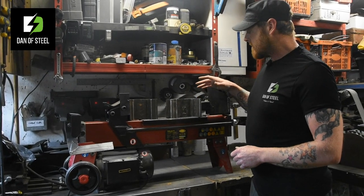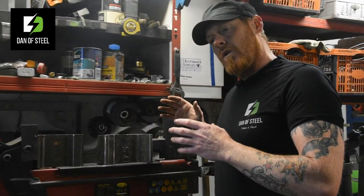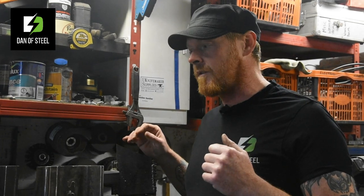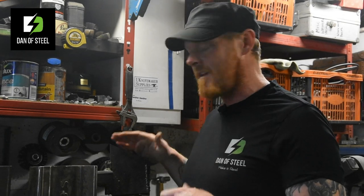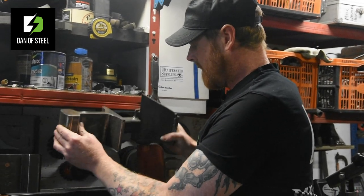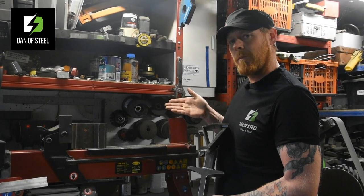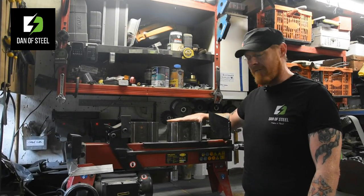Then the die themselves, the key to these is very much the fact that you want to be able to change them quite quickly. So just taking a load of scrap steel that I had from the Vandersander build and also the Revolution 2x72 build. This is all 10mm plate, 6mm plate, whatever I had laying around. I made these simple die, which as you can see, insert directly over the top of the original setting. So if I ever wanted to take this back to being a log splitter again, of course I could do. So that's very much the key to this.